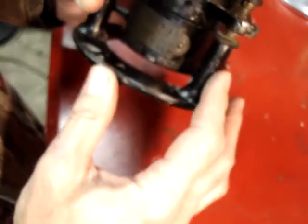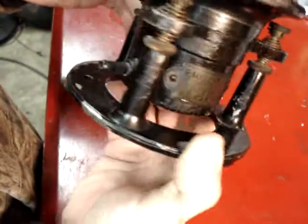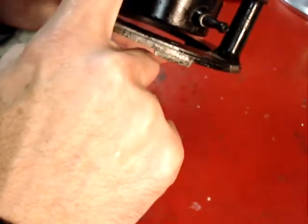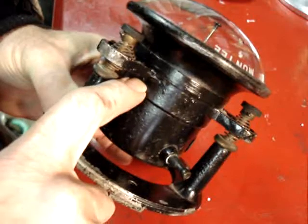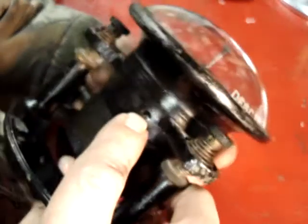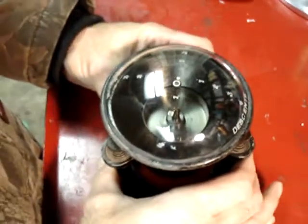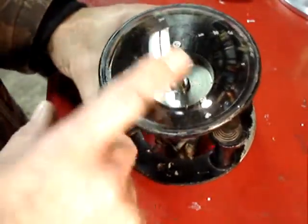As you can see, it's got a cast aluminum base and three shock-mounted pedestal mounting. It's got one outlet source for vacuum and there are two small inlet ports that are reduced in diameter as they go through that hole there, so when the suction is applied, the air comes in there and accelerates the rotor. It's marked one, two, three, four on each side.